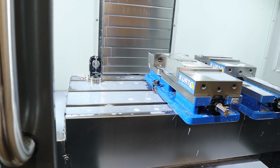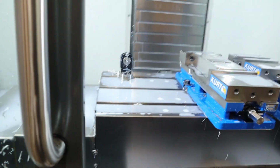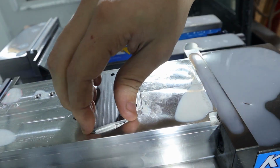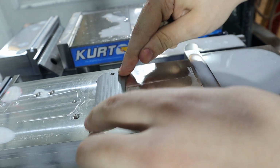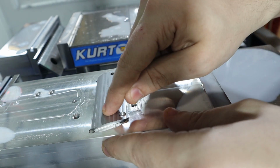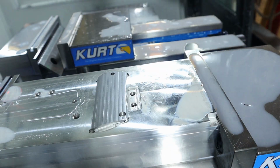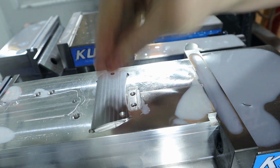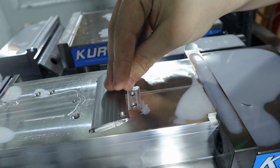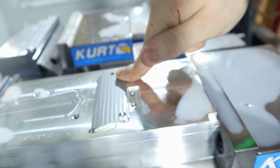Okay guys, I have run into the single weirdest issue and I cannot seem to figure out what is going on. Okay, so we know that our blade stock fits in this pocket, obviously, because it's in there. There's a very tiny amount of wiggle, but with the clamp it'll hold it right in place. So this blade stock is not the correct depth. I know this because I measured it with micrometers, and that's like 115. That's 10 thou away from where it's supposed to be, which is 125. Now that's probably because I messed up cutting it with the stock, but that's an aside. I only noticed it because the bearing pocket wasn't cut on the other side, and I went, that's weird.